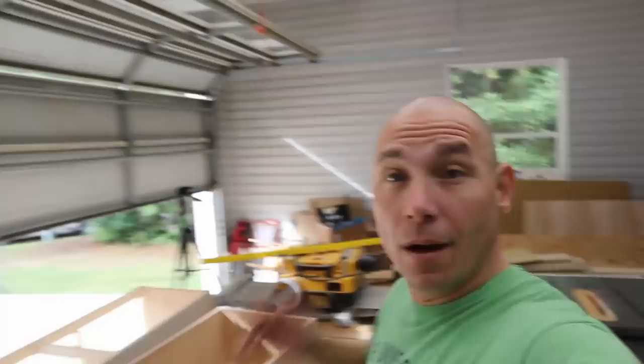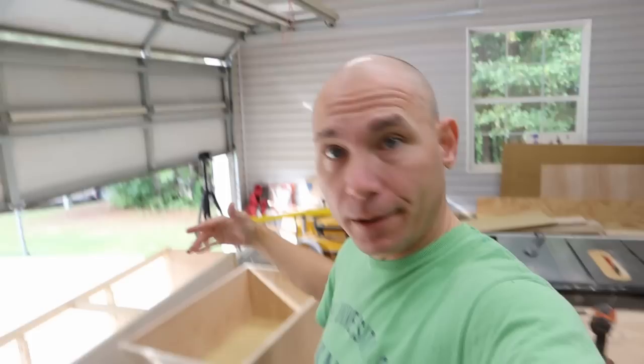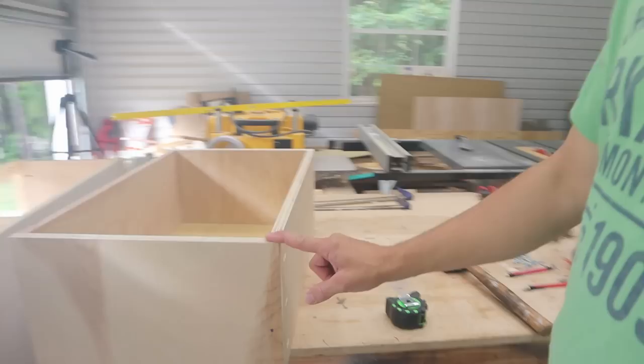Now it's time to make some drawers for our frame, and we're just going to start out with a basic drawer. This is a replica of Fix This Build That, Brad, on his channel. Go check him out. I'll put a link in the description to his video about building drawers, but I'm going to show you how I do it. It's the same way. We got pocket hole construction drawers. It's just plywood. This is 3/4 inch plywood, the same type of plywood we built the sides out of.